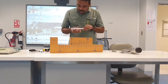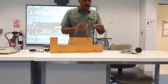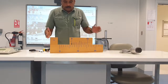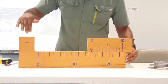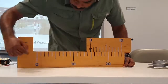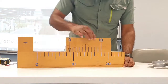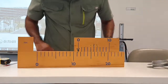That's why we need tools that provide very accurate measurements. We are planning to introduce you to the vernier caliper and the screw gauge. To help you understand how to use these instruments, I'm going to use a big wooden model of the vernier caliper. You can see it has two pieces — this is the main scale with graduated divisions marked 0 to 20, and there is a movable scale called the subscale which has 10 divisions from 0 to 10.